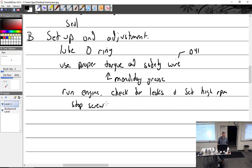You guys have digital tachs in your planes. Now I have the JPI digital - it's over red line at 2402. So you'd be surprised how temperature sensitive it is. On a very hot day on takeoff, the oil is thin. Anyway - set the high RPM stop screw. Where's the stop screw? It's on the governor - not on the prop. You don't set the high pitch stops on the prop, it's on the governor.